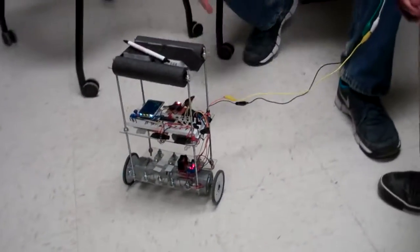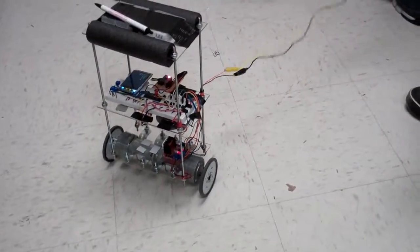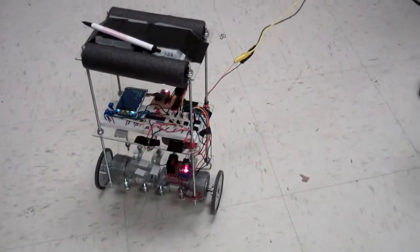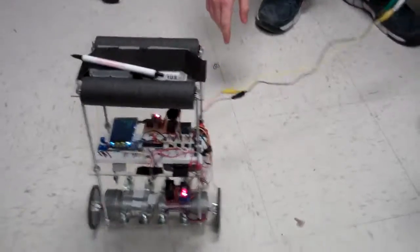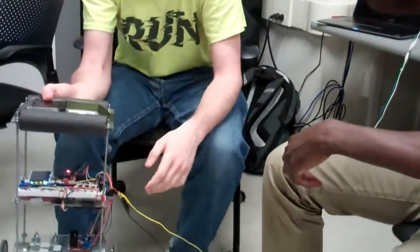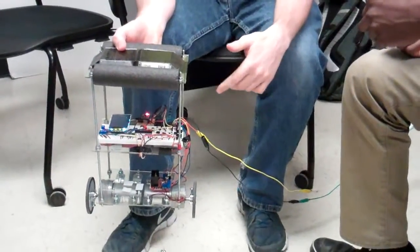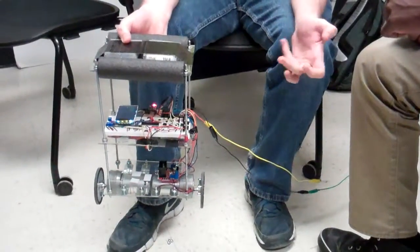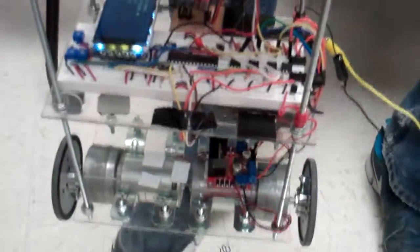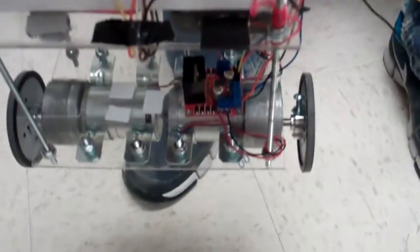So basically, we have a 12 volt, or actually 13.5 volt, power supply over there supplying somewhere around 3.5 to 4 amps, and that's specifically for the motors. And we have nickel metal hydride batteries underneath powering the PIC32, so that it's completely isolated from the motors. If we connect it to the same power circuit, then if the motor requires too much current, a lot of times the PIC32 completely powers off because it's not able to get enough power. It's very important that we opto-isolate the system. Nothing functions without it.